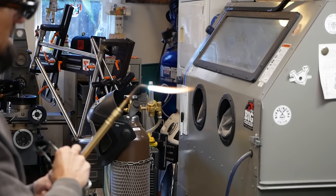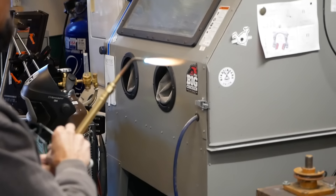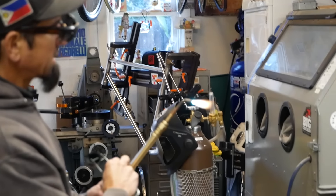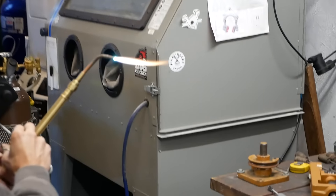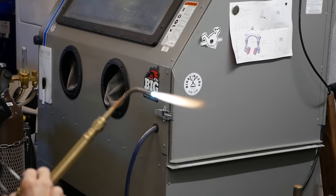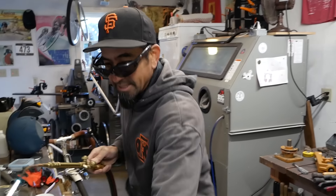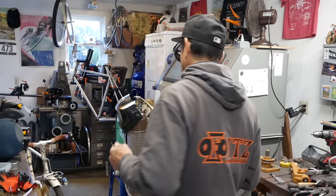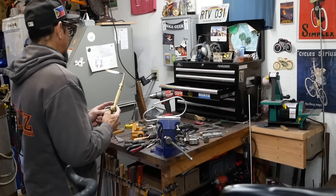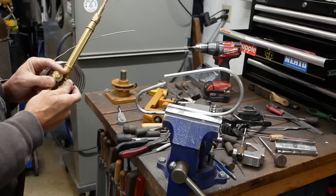I like to use a really light, small triangle flame. Paul Brody says you get it to the sharp point and then back it out a little bit so it's just fluttering at the point - just a small little flutter. If you have it sharp, that's kind of like you're trying to weld with it. We're just trying to have a concentrated heat but not over-penetrating. It's just one of those things you start to feel.